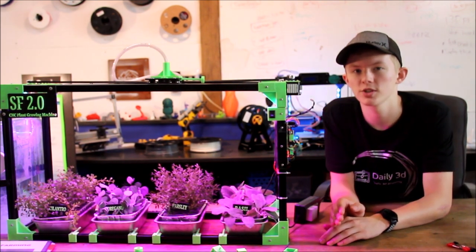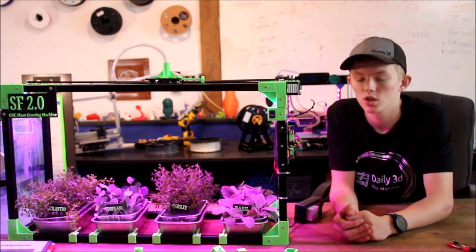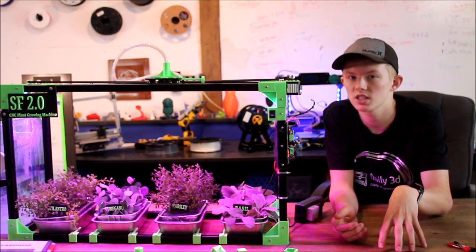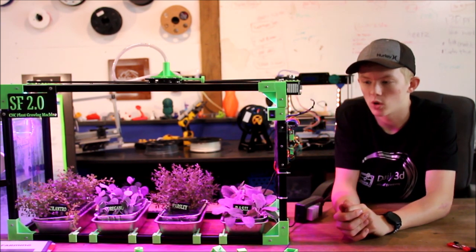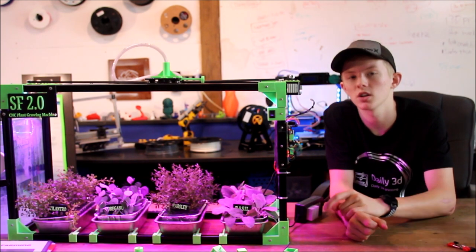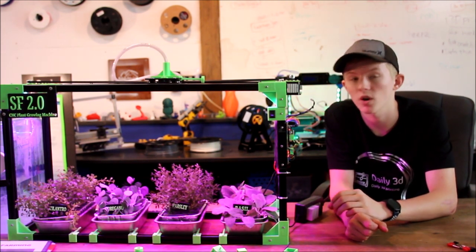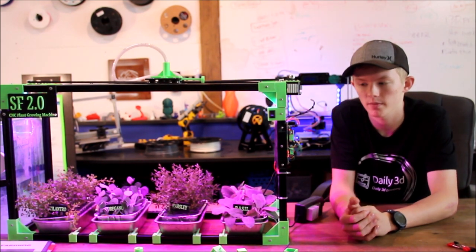So I did some research and learned that you can have two loops running at the same time in one code. So I made a separate loop for the RTC module and then a separate loop for the plants to grow. Once I got that hooked up, it worked a lot better because I could keep my delay on the plants, but I could have the RTC code always running, so that whenever it's 8 o'clock, it can turn the lights off and not be delayed any.